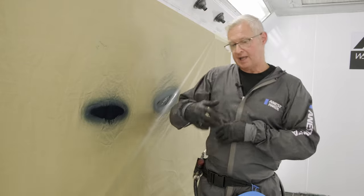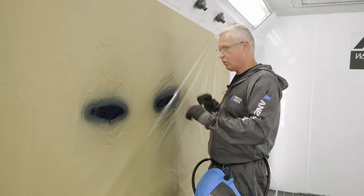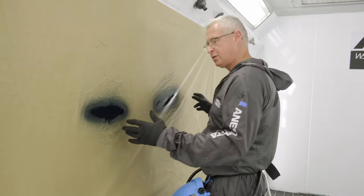With the Series 2 1.3 HD, there's a nice flat pattern — spread out exactly the same, running evenly across from one end to the other. This means it's not center-wet anywhere. From an application point of view, if you don't quite get the overlap right, the back of the pattern will keep working for you and filling in imperfections. The lay-down is nice and even all the way across the pattern.